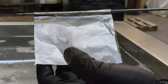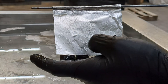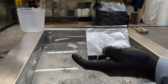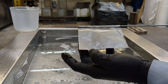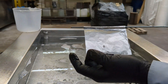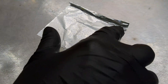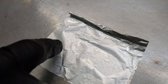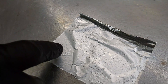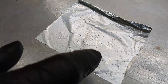This tank is around eight years old and we're still getting some really good cavitation marks on the foil, so that's a successful test indicating good ultrasonic activity. What we're looking for is good, even coverage — you'll see the little markings across the foil. There are some patches with blank spots, but that's acceptable.